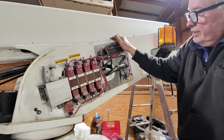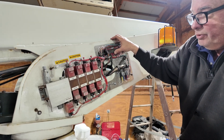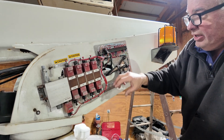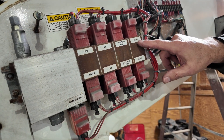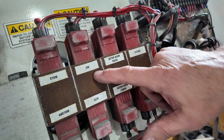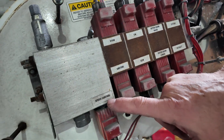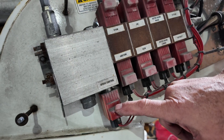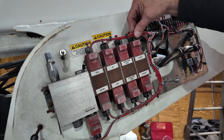As long as we have the cover off the control assembly here, I'd like to just quickly point out a couple of features. These are our solenoids right here for all the different functions: extend, retract, outer boom lower, outer boom raise, clockwise, counterclockwise, our stow and unstow, and our high-speed and low-speed solenoid right here.